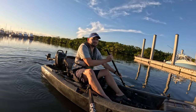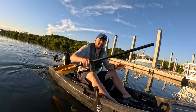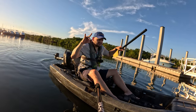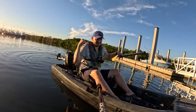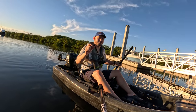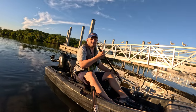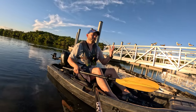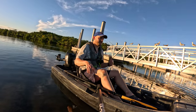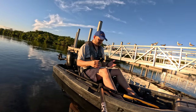So what have we learned today? We can go six miles an hour. At half throttle we're at about five miles an hour. This boat has a maximum hull speed of about five miles an hour — the motor's sheer power pushes it to six. But you go 100% throttle and only gain one extra mile per hour, when theoretically doubling speed from five should give you ten. It doesn't hit ten because the maximum hull speed is five miles an hour.